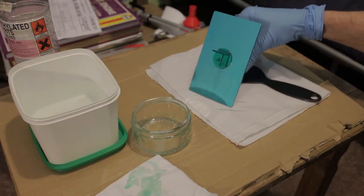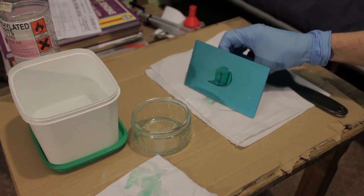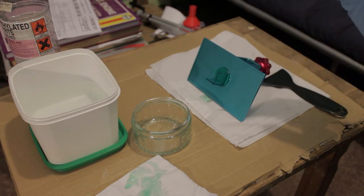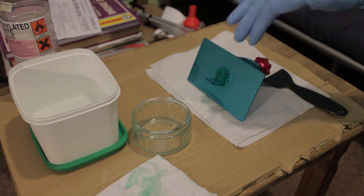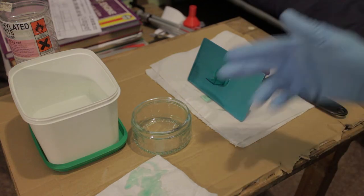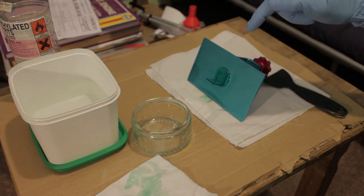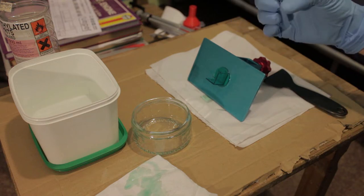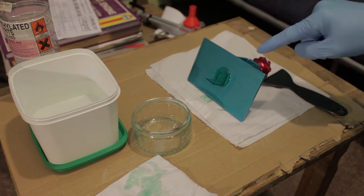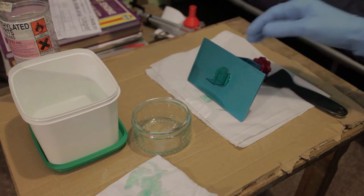So we've got the first print on the build plate there, as you can see, and I must confess to a long moment of uncertainty, because as I mentioned previously, you can't see this building up each layer, because it's dipping into the resin. So until it gets to a certain height, you can't actually see what's on the build plate. And I had a long moment of uncertainty when, after the first three or four layers, I could hear it sucking back up off the FEP film. You could hear the pop as it came off, and then I stopped hearing that, and I did have a concern that only the base or part of the base had stuck to the build plate.